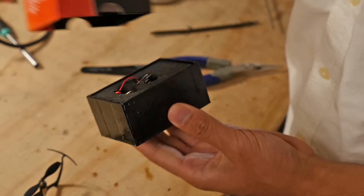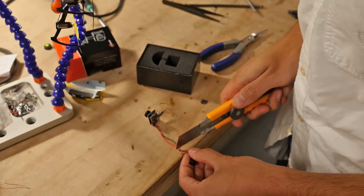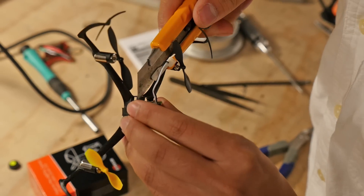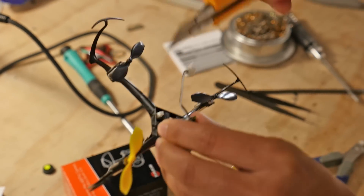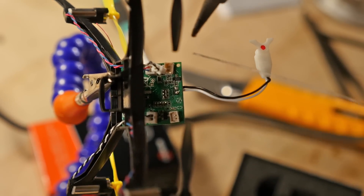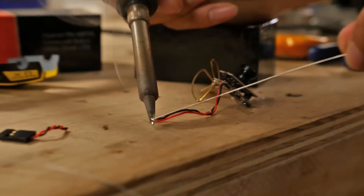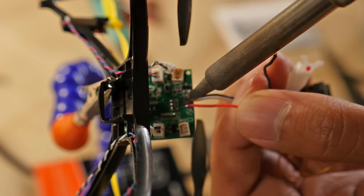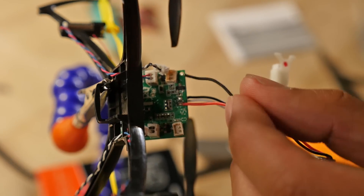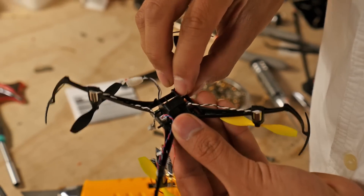I'll show you — I'm going to solder them in. First thing: take the camera out of the box. You'll notice it has a lead on it. Cut it to about two to two-and-a-half inches, but measure out your unit first to make sure you have enough cord to reach wherever you want. Next, remove the flight controller board from the quad so you can get to the solder points, because on top they put a little silicone adhesive that you'd have to scrape off. Just unplug the two pins and pry it up. Once you do that, make sure you solder the red to the white — in this case white is positive and black is negative. That's the hardest part. You want a very fine, pointed iron — an SMD-type iron is best. If you don't have one, a blunt iron works but takes a little more time and skill. If you make a mistake, you can heat the iron up and flick the solder off.